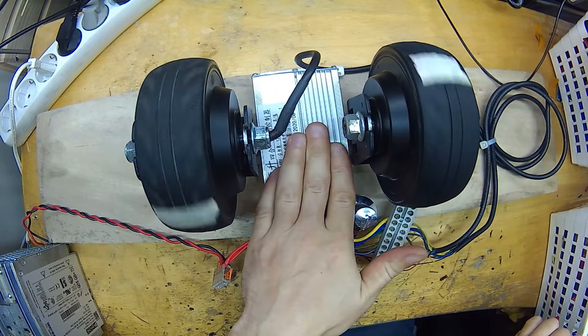The phase on these brushless motors can actually have an offset. When I applied resistance to one of the motors, it doesn't drop out of phase right away. That means these motors can indeed rotate at a slightly different speed and still work okay with one controller — and that's all we need.